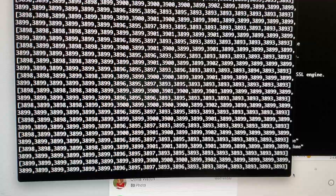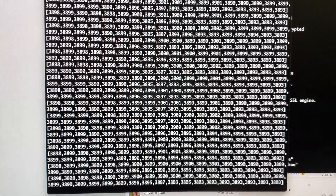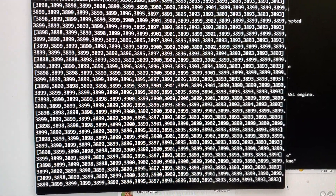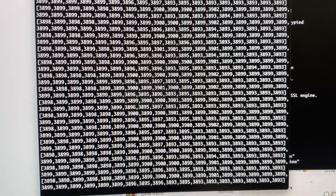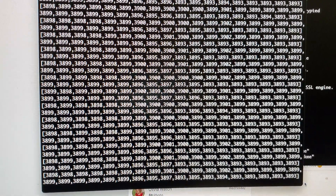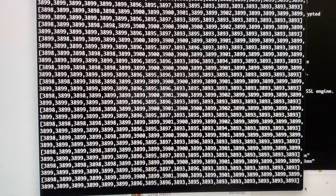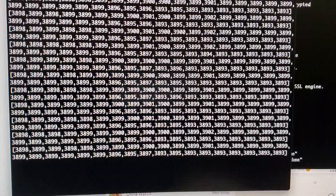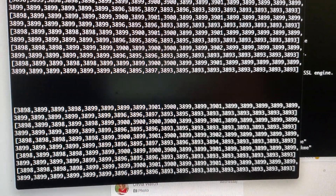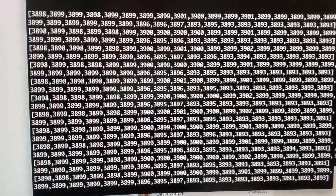At the same time, that M5 Dial ESP32 is sending me all 36 voltages by MQTT, which is basically an IoT-type protocol, sending the array of all 36 voltages to an MQTT server. I'm subscribed to that same topic — which is 'voltages' — and it's showing me all of the voltages here. You can see they're all at 3.899 or 3.900. I know it's all working.